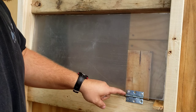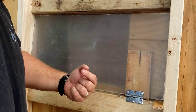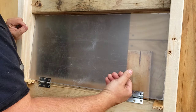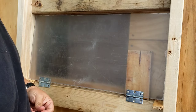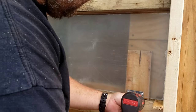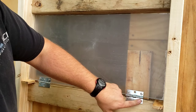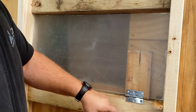One thing I've noticed — I'm definitely going to keep the pop rivet heads to the inside of the glass. When you install it, make sure your hinge is facing up, and put a washer on the back as a backer because that'll add strength and keep your plexi from cracking out. Let's go ahead and put in these last two screws. I did have to put it in at a little bit of a downward angle because of how high the hinge lifts, so you'll have to watch that with your hinges.